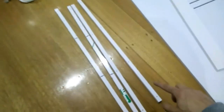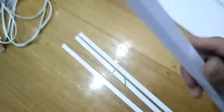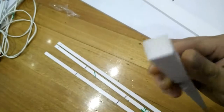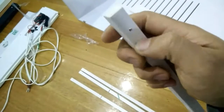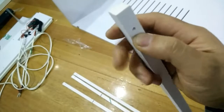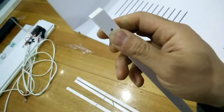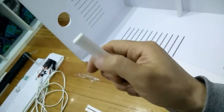So there's 4 holes, and drill, you can see this piece is actually 14 mil by 14 mil. It's a square block. The board thickness is 14 mil. Now, when you drill it, drill on the shiny side. See how there's a shiny side? And there's always one side with the protective glad wrap layer. So drill on that side with the protective layer, or the shiny side, and not the rough side, because that's the middle of the core. So the most strength you get out of it is by drilling through the shiny side. So, yeah. So just think of it shiny. Not shiny, rough, shiny. So drill through the shiny side.